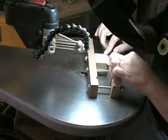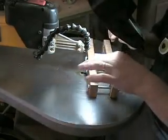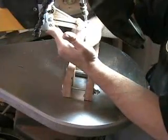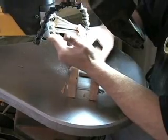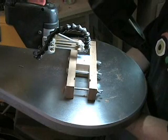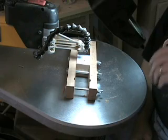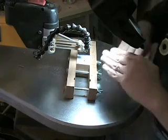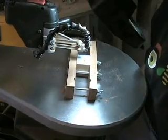You'll notice that I put this in a different place in the jig this time. It's easier to put it in the center, and when I put it on the end, it didn't clamp it correctly, so we're doing it this way. It's also more difficult to feed blades on a compound cut because there's already holes there. So you can feed through one hole and then it'll catch on the next one. So it takes some patience. Alright, let's zoom this in and cut this side.